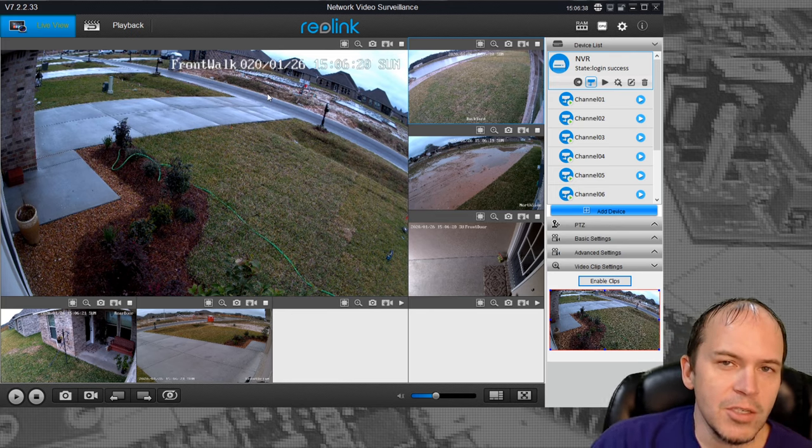When selecting a system, think about how many cameras you want and build in some expandability. If you fill eight channels there's no room to grow on an eight channel NVR, so consider the 16 channel model and start with five or six cameras. One suggestion that isn't really a negative but would save frustration: Reolink should include a wireless mouse, as we tried three or four brands before finding one that works. We'll link the compatible mouse in the description.